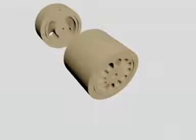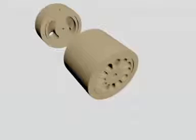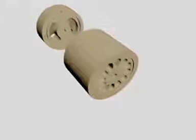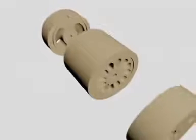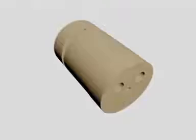The PX is simple yet elegantly designed. The housing contains a ceramic rotor, the only moving part in the device. Surrounding the rotor are a sleeve and two end covers. These ceramic components fit snugly around the rotor, forming a tight seal that prevents pressure from escaping.